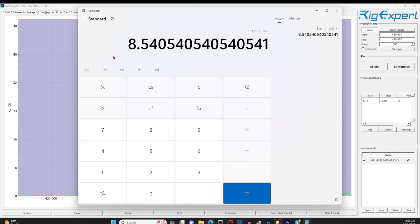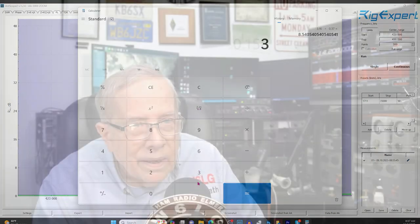The new connectors are 8.5 times more lossy. The old connectors — dirty, filthy, that I've had forever — had almost no loss at 450 megahertz. The new ones had about 3 dB loss. That was 10 connectors; it's not likely I'll use 10, but I am using a couple, and I've got to be really accurate in measuring the transceiver.